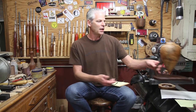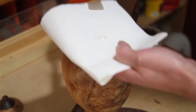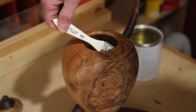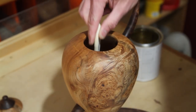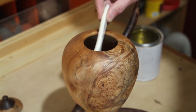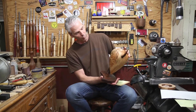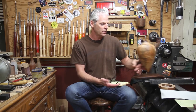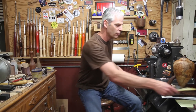Most of what I do is just turning, so I'm going to put it on the lathe anyway, and I rarely set up a fence. Another question was about the lacquer - I just took a paintbrush, put on about three coats inside of there, and just kept building it up so it filled in any little voids that might have been in the burl. The spots around there I glued up from the inside a couple of times, which sealed it, then I put the lacquer on. It works pretty good - you put a few coats on and it's pretty easy to do.